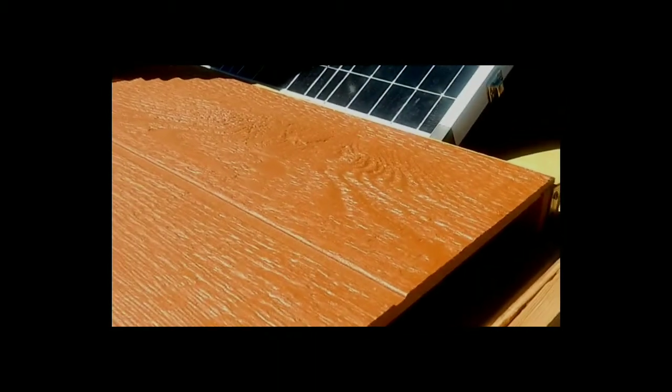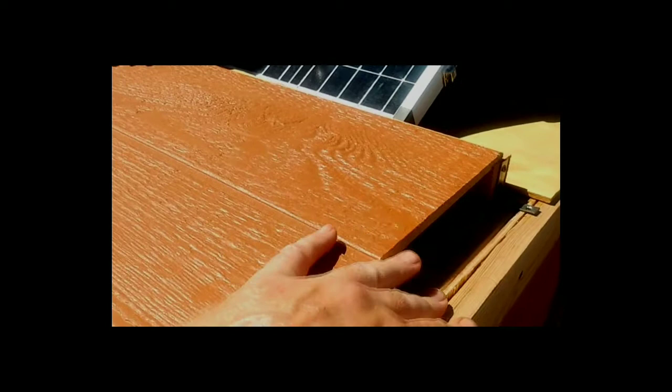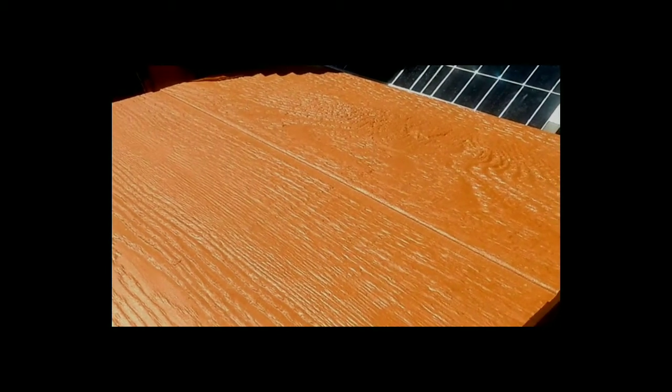Part of the design is that there is an inch or more of space between the inside plastic water cube and the outside wooden box. The hot air that might build up in there can just flow right out through these little gaps. I've actually got a tarp on top of it too, and as I lift this up, a whole bunch of cool air spills out, because the water tank keeps the air between the tank and the wooden box very cool — even on a hot day like today where the temperature is expected to reach about 80 degrees.